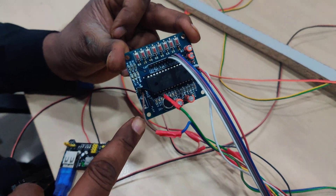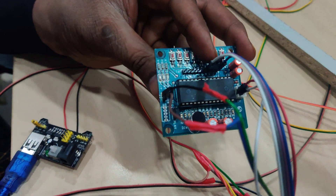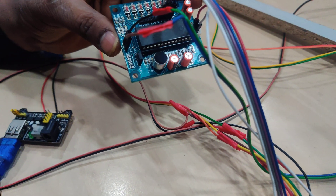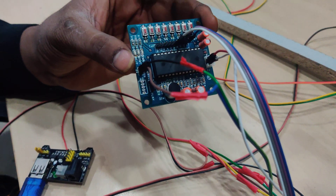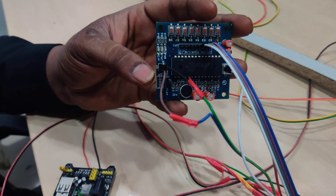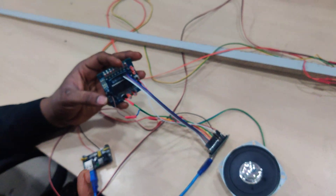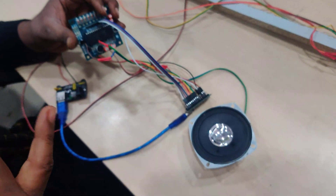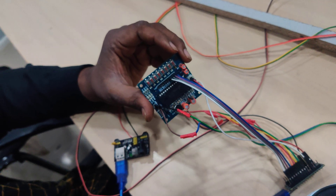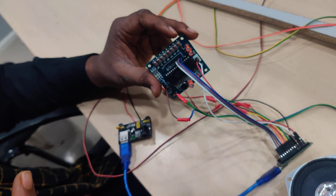There are two options: record and play. If you keep it in record mode, you close the switch and speak your voice into the mic, which saves it. Then you change the jumper to the speaker side to play that voice again, either via program or directly by switch. I saved only four voices for my application, though you can use all eight channels.